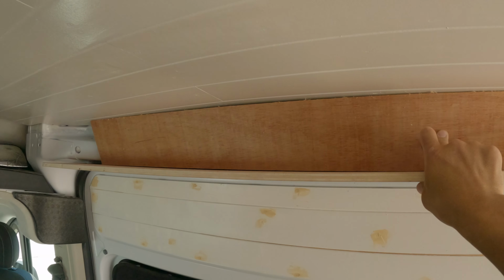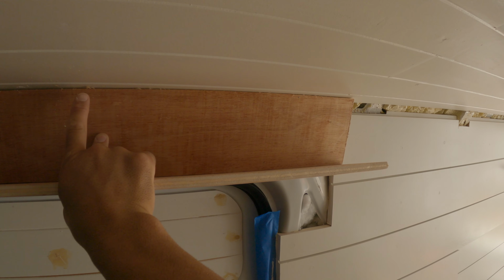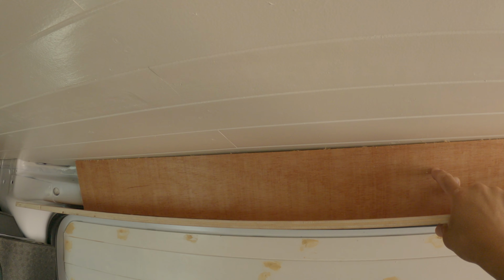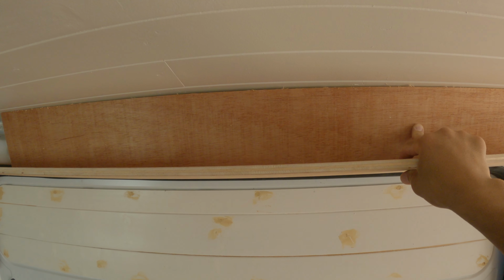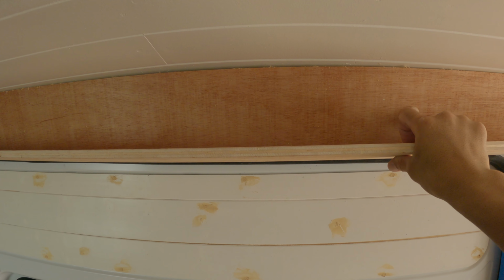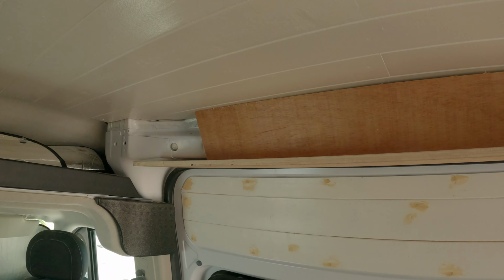Alright, so this is how this should look. It ended up being a 25-degree angle, top and bottom. I can't push it up with one hand, but that space will be closed when I push it up. So now we can screw this back piece into the metal, trying to keep this angle, and then we can take some wood glue and shoot some nails up from this piece into this piece. Then we should have the basic frame of our shelf here.